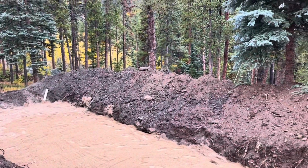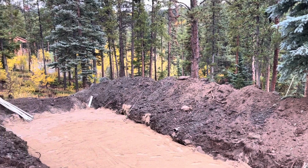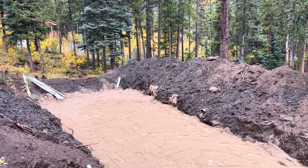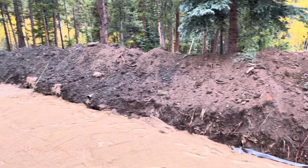Yeah. And so then that's 3 feet of sand. After we dig it out, we bring in 3 feet of sand, and that sand is because that's the stuff that's been scientifically proven to continue to absorb effluent for years and years to come.